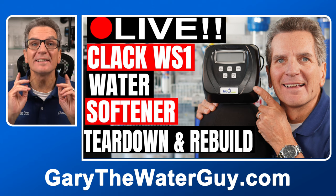Tip number twelve: do you hear water running to the drain when the water softener is in service, or does it keep going into error code whenever it goes through a regeneration cycle? The valve needs to be rebuilt. If you have one of our Hume or any Clack valve water softener, it isn't as difficult as it sounds. This video goes through the whole process in detail.